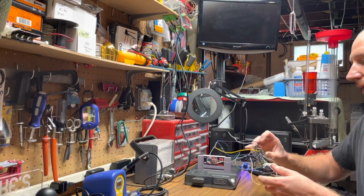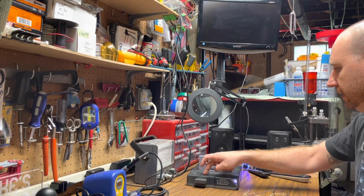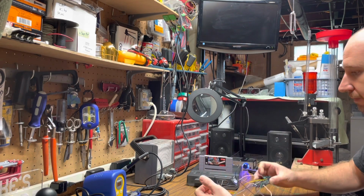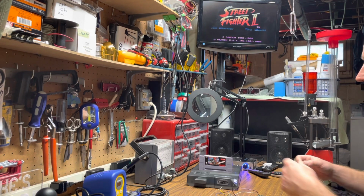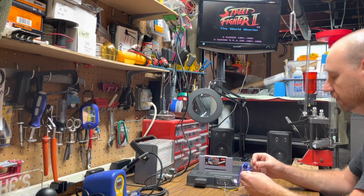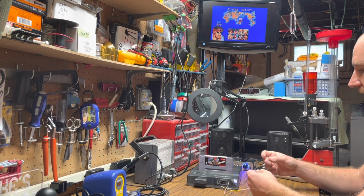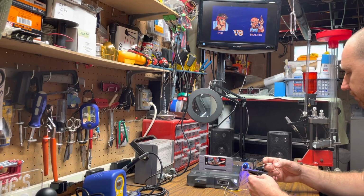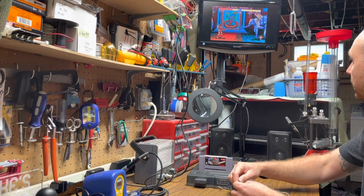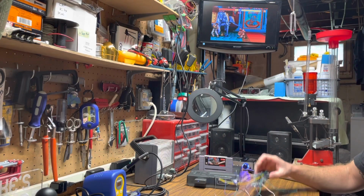All right guys, I don't know how this is coming out, but got this all soldered up. I got the Retron 3 HD right here. We're gonna just turn it on, we're gonna test it. So let's see what we got. Basically, we're just gonna touch each button to ground and make sure that it activates properly. Alright, so let me start with the start button. I'm basically gonna use these two wires here. There we go. Start button works. Okay. Try down. Down works. Up works. Try right. Alright. So we should be good, guys.